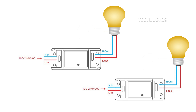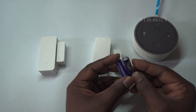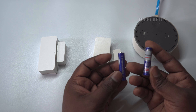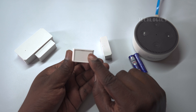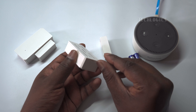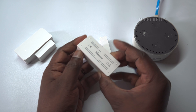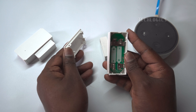This is the wiring diagram for the Sonoff switch to connect to the power for the light. Note: in this demonstration, we used sensors for both front and back doors. You can follow the same procedure to set up a single sensor for one door automation. The first step is to configure the door sensors with Wi-Fi and add them to the app. The second step is to configure the Sonoff switch with Wi-Fi and add it to the app. The third step is to create scenes to execute the door remain open alarm setup.